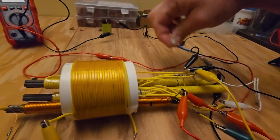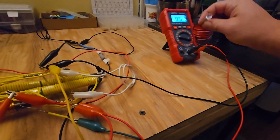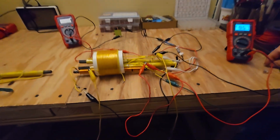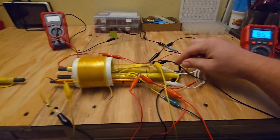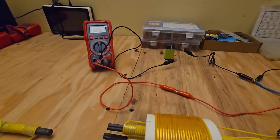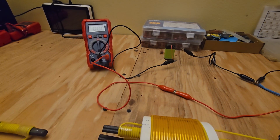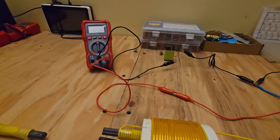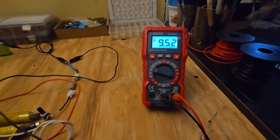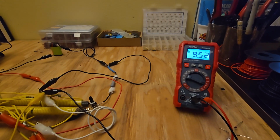And I notice the wireless power is very present near the battery too. And even the voltmeter, because anything connected to the circuit becomes part of the circuit. So now I will try and fine-tune it again with the potentiometer to get it to the point where it consumes no power when the resonant feedback takes over, which it just about has. There. We now have the resonant feedback taking over via fine-tuning from the potentiometer.